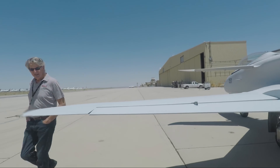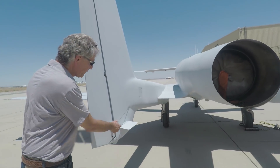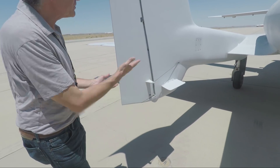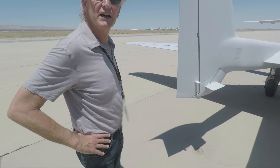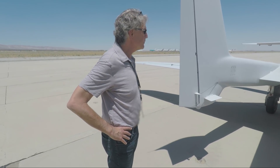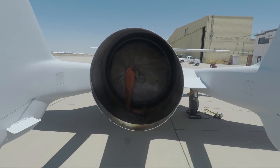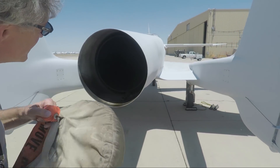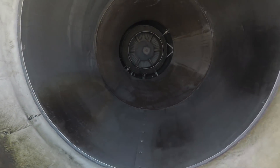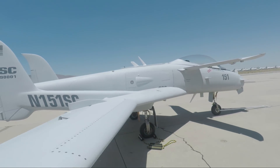This is the Iron Eagle 3 movie plane. It has an asymmetric inlet — looking straight on from the nose you see a biplane-style look with the top wing, but the engine is only on one side, sucked back into that cavity and at an angle. It doesn't imbalance the plane because we have an exhaust duct that straightens out the flow — it's mounted 10 degrees off center but the flow straightens out as it gets to the end of the airplane. You can see the rudder is controlled by a cable that goes all the way up to the pedals with a bell horn — very much like what you'd find on a hand-built airplane.